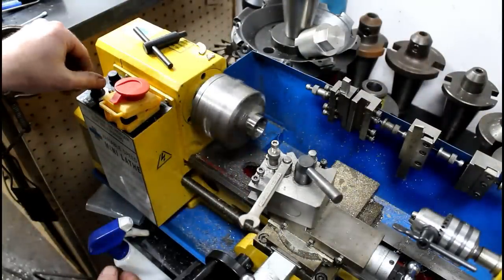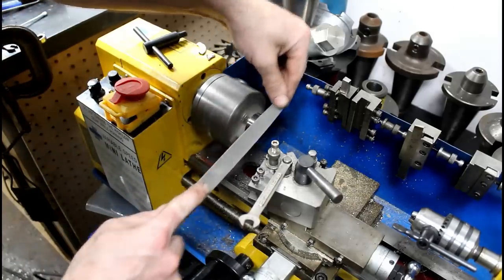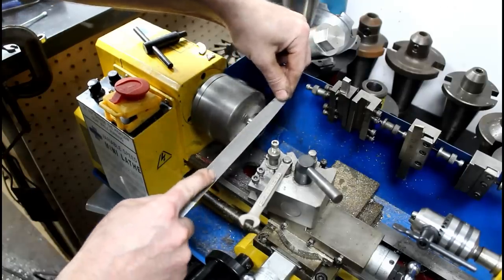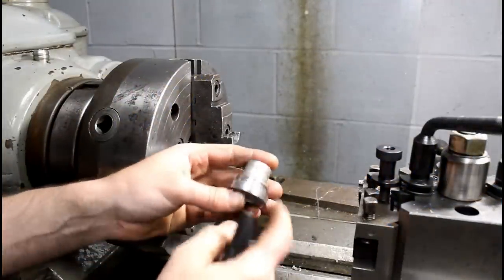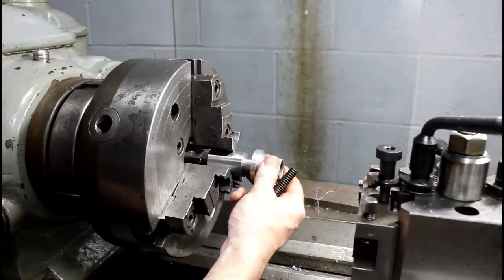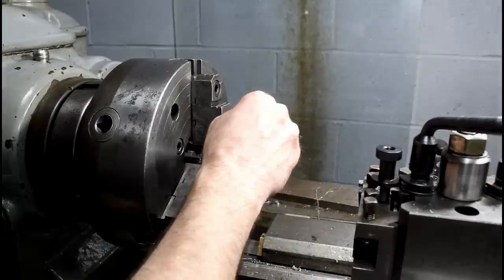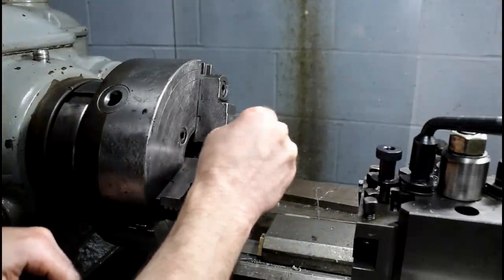Using a little lathe to finish cleaning these bushings up, or these spacers, whatever you want to call them, repair rings. So I need to turn my spacer down this area to 27.5 millimeters. I just turned me an arbor to hold it, and then I'm just gonna glue this on. I think that's the easy way to, and I'll just heat it to get it back. Just an easy way to hold it.